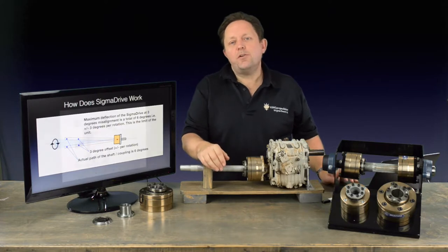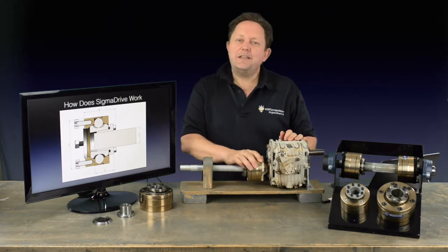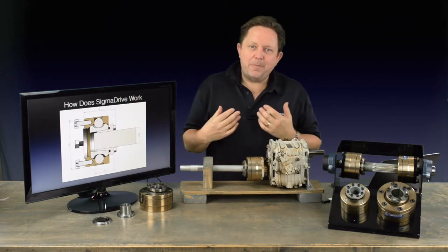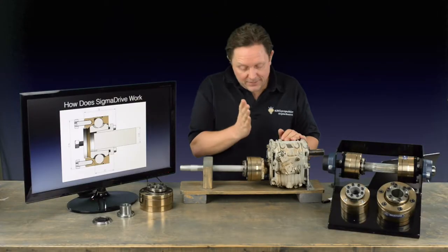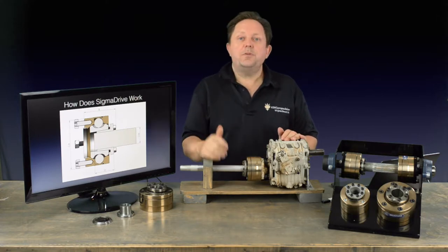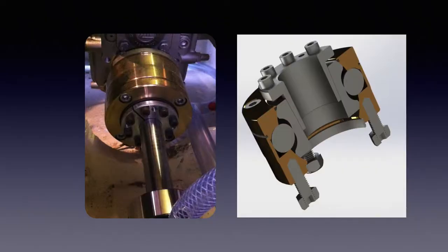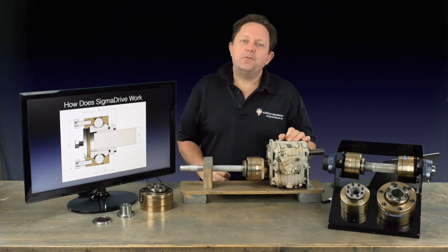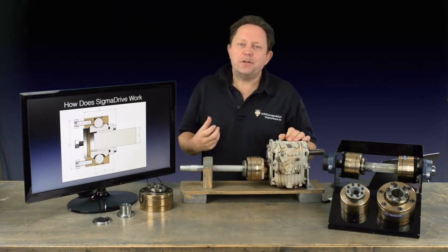The unit is also hollow, and it uses a clamp-style system to grip the shaft. This is very standard in the commercial world, but quite a novelty in the sailboat world. It gives a good 360-degree grip on the shaft, rather than a point load that you would get from a keyway. It's not meant as a drive saver — the clamp is actually a taper-lock collar that bolts onto the shaft, and then the drive bolts directly onto the output flange of the transmission. There's no thrust bulkhead required on the 55 and the 100 models. This unit is all metal construction and is able to take the thrust load, unlike the rubber style of competitors. The thrust of the propeller is transferred to the hull and pushes it along from either the thrust bulkhead or your engine mounts. The Sigma Drive transfers the thrust load to the engine mounts and pushes the boat along safely in this manner.